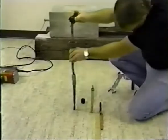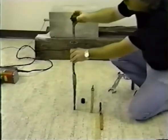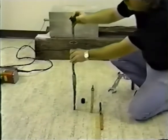If the gauge can be inserted onto the tool and the blades touch the gauge, the blades are within tolerance. If not, the blades must be changed.